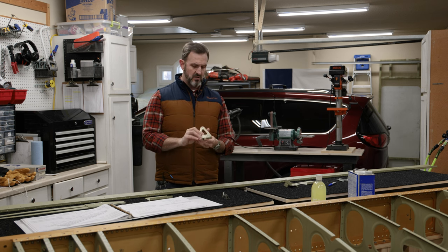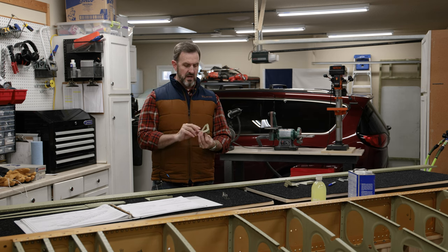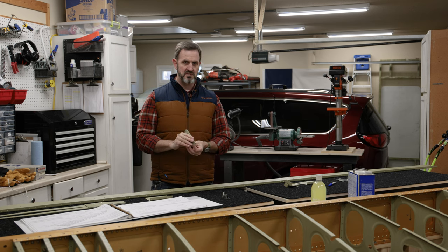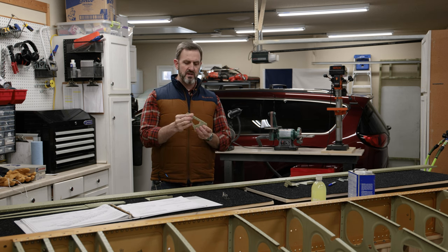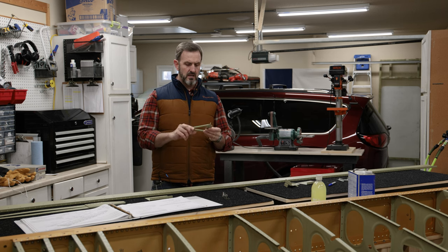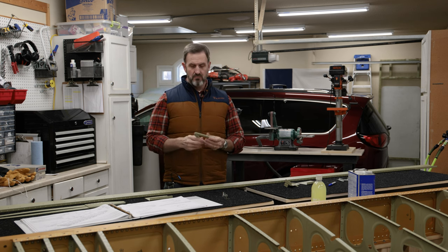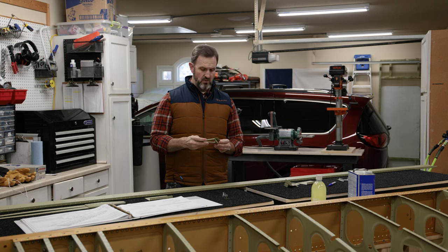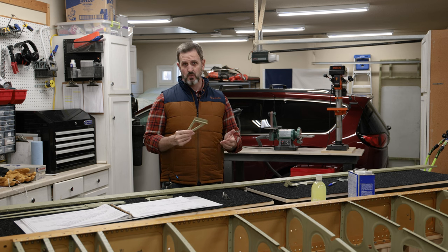And I also, especially on the side where the aileron bumps up against the flap, I think there are some people that talked about having some clearance issues there. And normally you're just going to have to shave away some of the material on either the ailerons or the flaps. So to hopefully forestall that, I flush riveted both sides, mostly on the hinge bracket. Not all the rivets, but a lot of them I did. So hopefully that should make it so there's going to be no clearance issues. Not that that would be an insurmountable problem, but I thought it was a good idea, so I went ahead and did that.